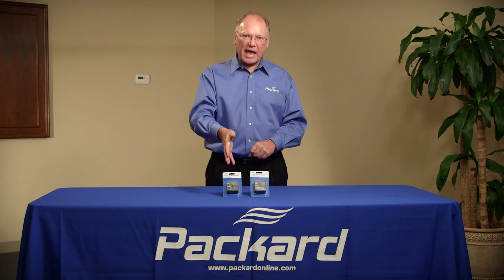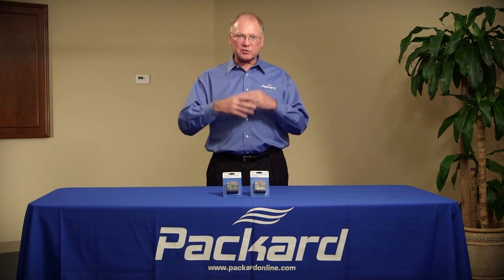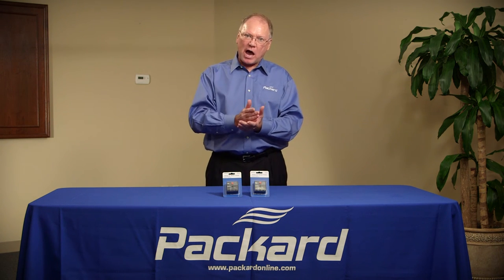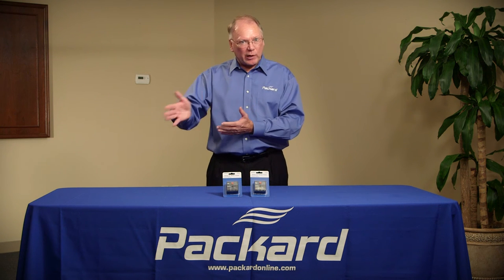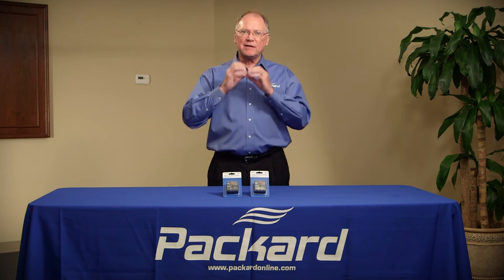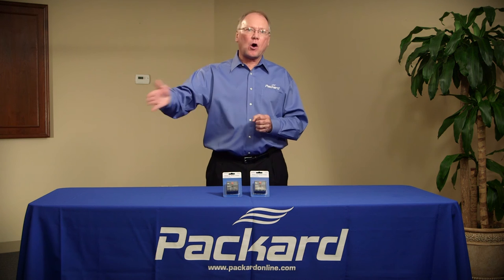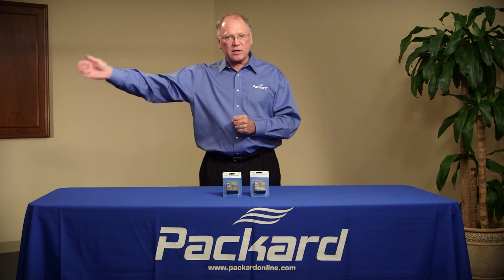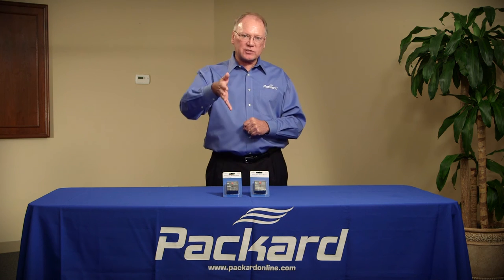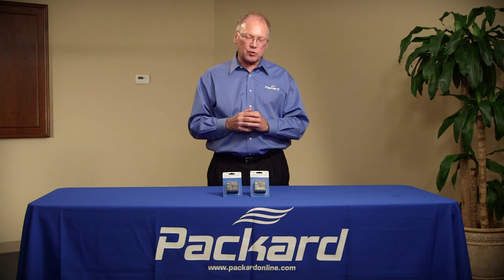The time delay on make can help us in the case of power shortages or power outages, where the power may be trying to come on but it could be hammering that compressor — where the compressor is seeing voltage for a short period of time, then the power goes out again and comes back on, goes out, and ultimately levels out. That's not good for the compressor, so we may want to use a time delay on make for that situation.